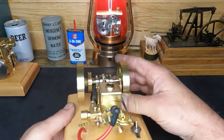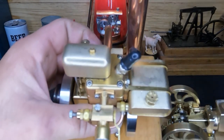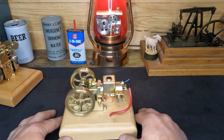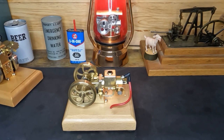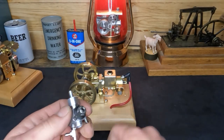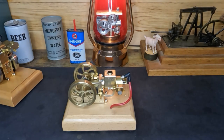I'll show you the carburetor on this — I'll bring this other one up. They're essentially the same exact carburetor. This one here is mounted with a flange and then this one here is threaded into the head. So I set out to make an adapter to try to run a carburetor off of a nitro engine, and this is what we made. When it came to these threads, we were in for a real Shanghai surprise because they are metric, and the thread pitch is so stinking small — but we got it.